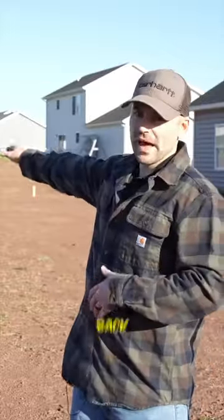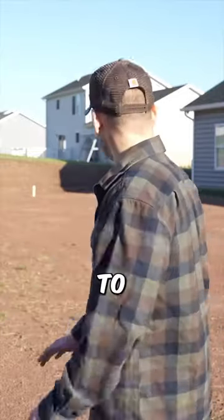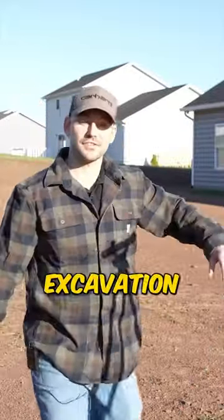After shooting grade, we had a nine-inch difference from the back over to here. So we know we need to taper when we cut this out — from nothing where the transit's sitting to about nine inches up against the house. There's going to be a good bit of dirt that has to come out against the side of the house during this excavation.